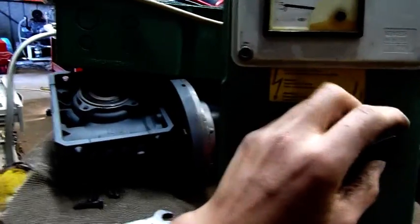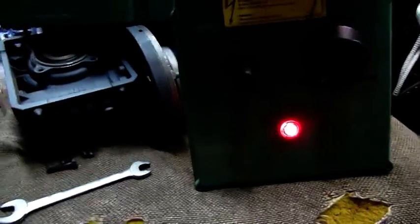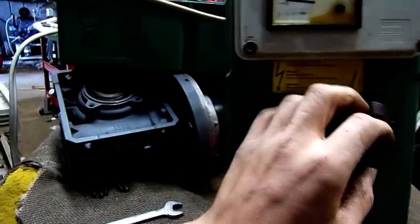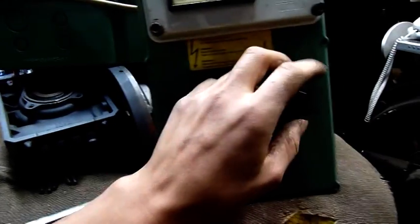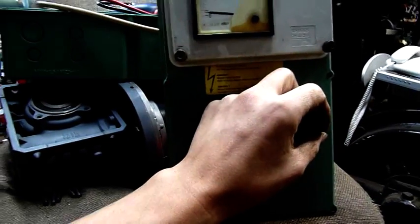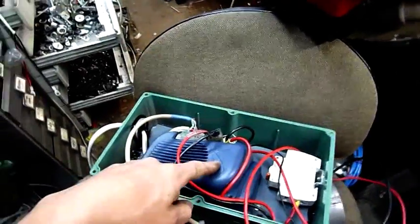I need to build a test bench for these. At work we've got a battery tester which is just a DC motor and a brake caliper and rotor — you start the motor up, start applying the brakes, and see how many amps the meter pulls and how low the battery voltage gets. There are a couple of sus solder joints on the B plus and B minus input, so I might touch those up — they won't be helping. I'll give the main relay a quick resolder too and check the capacitors, because there's a bunch of big DC caps in there which can break away from the main board from vibration. One of the ones I fixed at work had caps floating around inside because they'd broken off — three had broken off and the fourth blew its top. I fitted new caps and it was good as new.